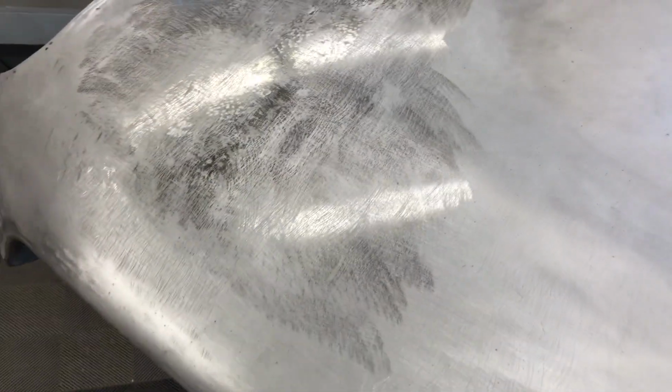Okay, now I'm behind the camera. I just finished the shrinking here, and you can see that's where you get all this burnished surface, and this is like as smooth as chrome. So you do have to scuff that back down when you're done. You can see this is that big dented area because I put a lot of heat in there. And then one thing the shrinking does is bring up and show the image of all the crazy work that's been done on this in the past.